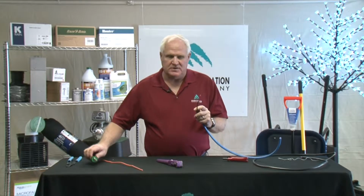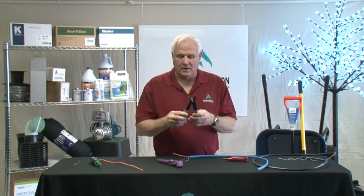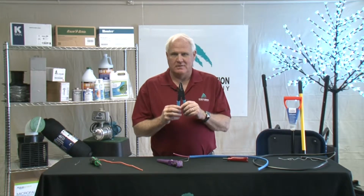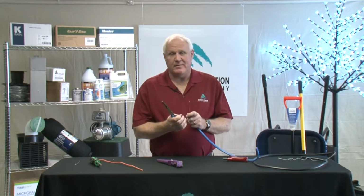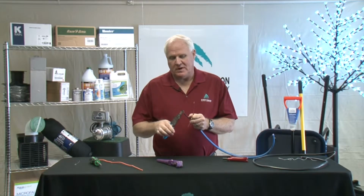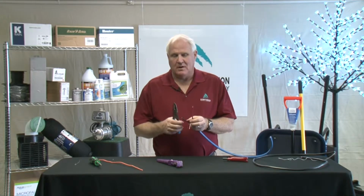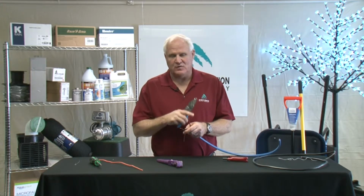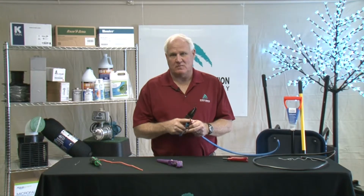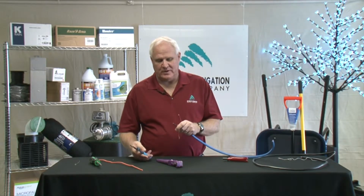And one of the things that you need to do typically for all wire is use rubber-handled wire cutters, because sometimes you may be cutting something that may be hot and you didn't know it. So if you cut through, you won't get a jolt. Most irrigation systems aren't that hot, like 24-volt systems, conventional systems, but 2 wires will give you a jolt because they're about 40 volts on each side. So you can run into a scenario where it could bite you a little bit.